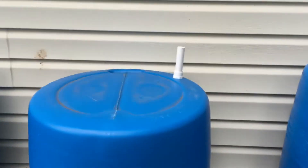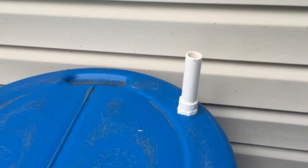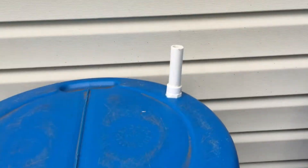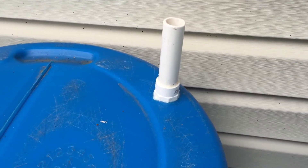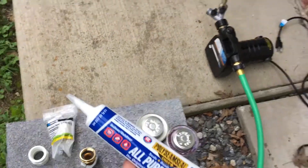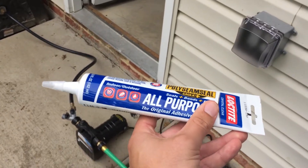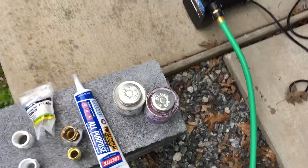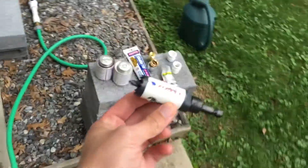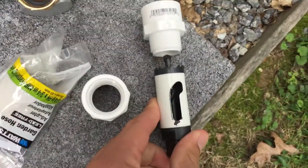What I really should do is put some mosquito netting over top of the vents so that mosquitoes can't get in there, but honestly I don't think it's probably hurting it that much. All these three-quarter pipes that I connect to the barrels — it's all just threaded in there with some all-purpose polyseal caulk around it. I didn't use any pipe tape or anything, I just used caulk on everything. All you need is a three-quarter inch hole saw, because it fits perfectly for all of the fittings.